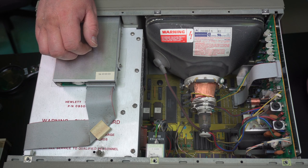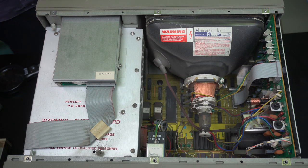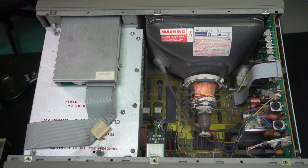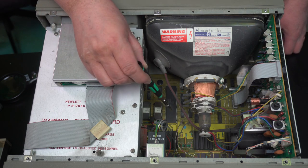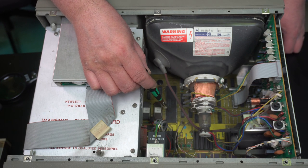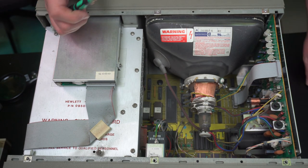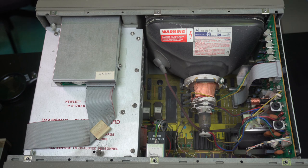The power supply is actually isolated in this big aluminium box, so that's relatively safe. And then you have the main board in the bottom — but don't try and go to touch the main board close to this TV circuitry, at least not without isolating gloves, or knowing that you've discharged the capacitors. That's a 68000 processor down there by the way. It's actually pretty clean, and with this kind of retro equipment I wouldn't suggest being aggressive with cleaning inside if they actually do work. If it's not terribly dusty, I would suggest just leaving it alone.